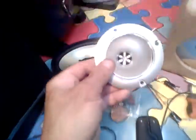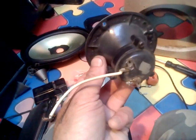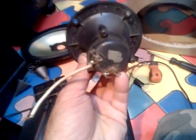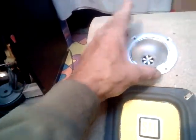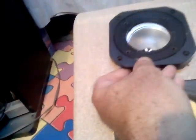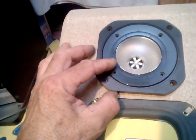I've got a 2.2UF for the tweeters. The tweeters I'm going to be using are a piezo design, but they're only 175 watts. I'm going to put a crossover on these — 2.2 — and they're going to fit in up here. I'm going to put a Technics housing around it — it came out of another speaker — hiding a bit of the roughness, so it should all match into place.